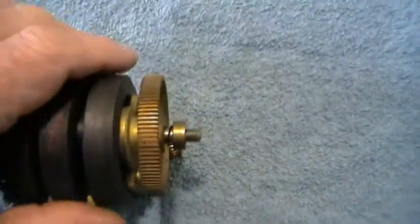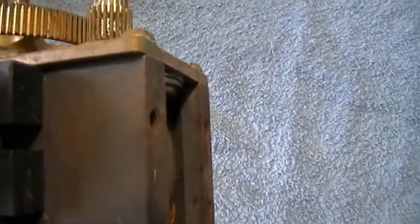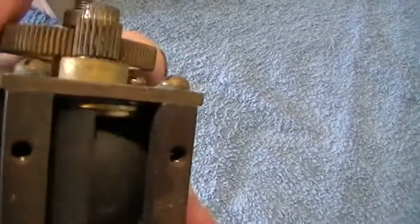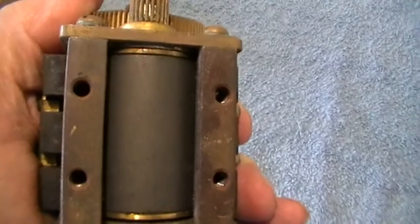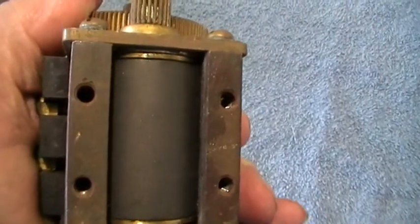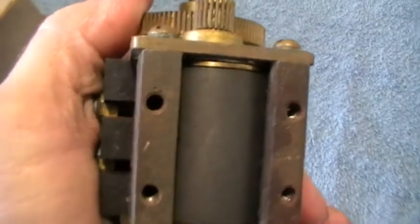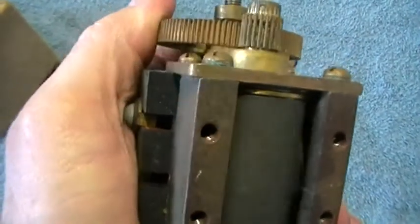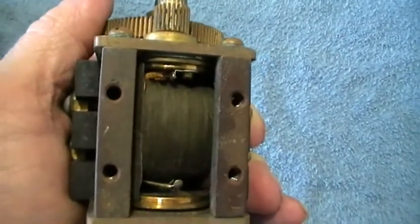It's three horseshoe magnets fixed to a large metal extended pole face. Inside, revolving at some speed, you've got a coil of many turns and a magnetic yoke or armature which revolves around inside. As you turn it you can feel the force — as the armature passes each pole you get resistance, and it sends a pulse of AC electricity out.